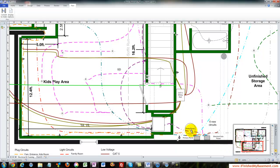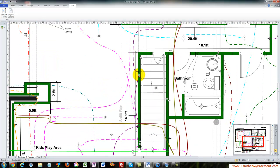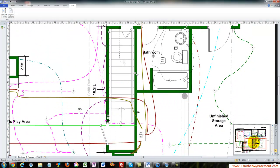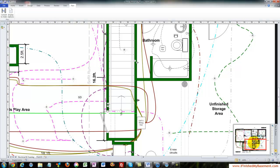Starting from the sub-panel, you see this purple line — it powers a plug right here, which is the fridge plug, then follows along and powers another plug on this wall, and then all this traveling is happening in the ceiling. Then there's a plug over here and four plugs for the workroom, so that's one circuit. I think there are 11 or 12 plugs on that one circuit. You want to use a different color and maybe even a different pattern per circuit so you can keep track of how many plugs or lights are on each circuit.